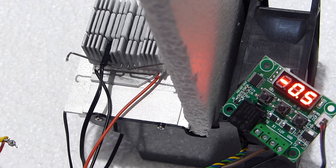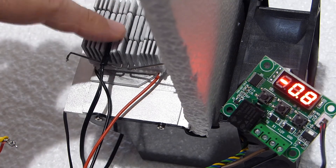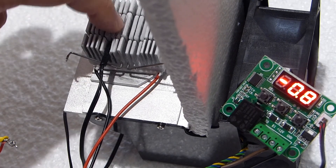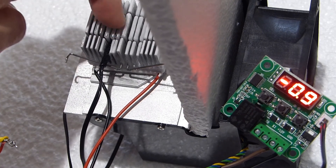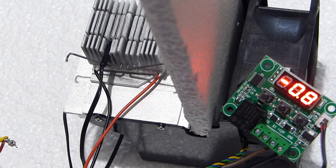After around 45 minutes — the same time it took for the smaller 12708 module to settle — this module reached minus 0.9 degrees Celsius. Wow! You can even see ice forming on the small heatsink. I am measuring the temperature directly on the heatsink surface, but when placed in a polystyrene box where the cold temperature needs to spread out, the temperature will be higher.